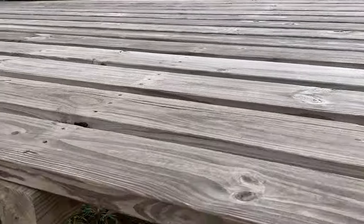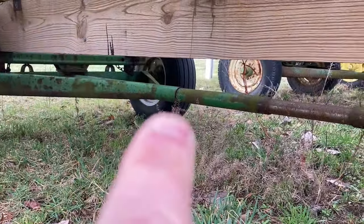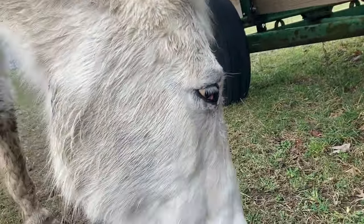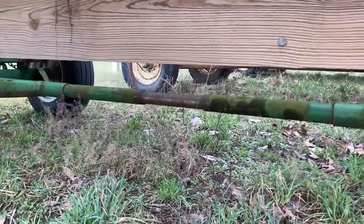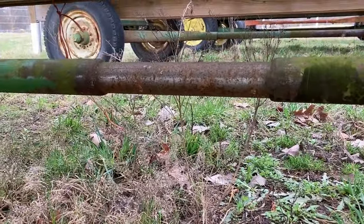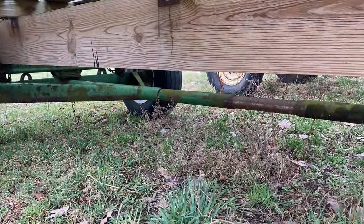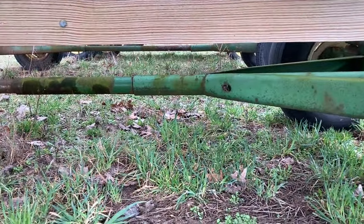One thing I did not talk about on the running gear is they are adjustable. The rear running gear starts right there and the front one starts right there. There is this big long pipe in the middle and they are extendable. What I actually did with this one is I had a section welded on there in the middle so I could extend it out even more. There's just a bolt that goes through the two there, and you can make that running gear longer or shorter to get to that desired length of wagon you want.